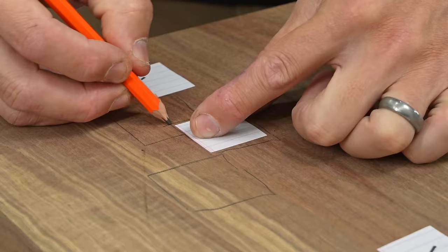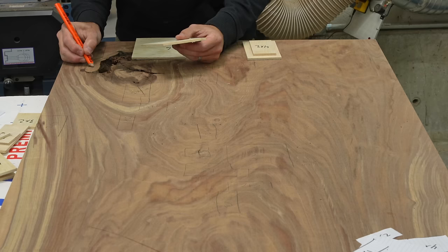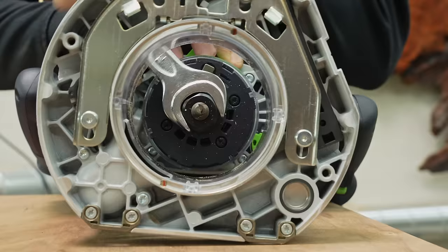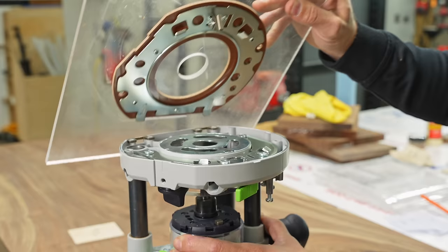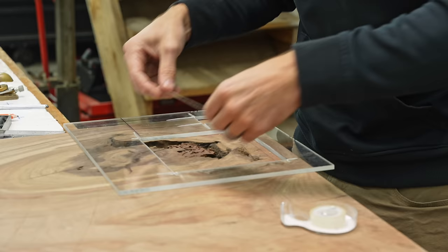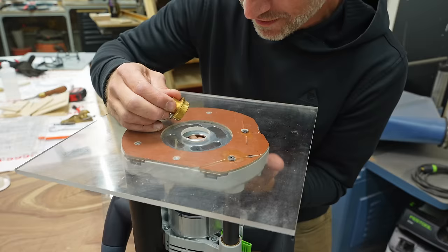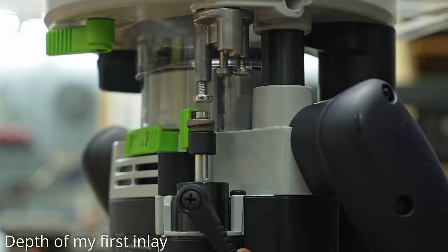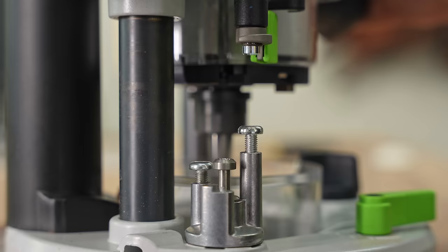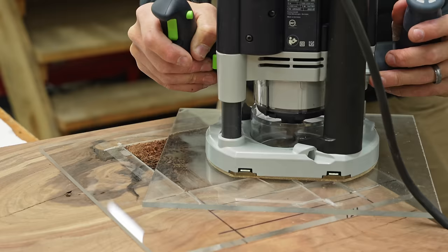I'll be really interested to hear what you guys think when it's all done. Once I had the visual representation laid out of how I wanted these patches to look, I was ready to start cutting the recesses. This is going to be done in four different sections since I thought it would be more interesting if the patches overlapped each other — I'd have to do it one layer at a time. I got my new big Festool router, added a piece of acrylic to the existing Festool base. I bought these pieces of acrylic at Tap Plastics for about a dollar a piece, cut a bunch of different sized squares. A brass bushing rides on that square edge and gives me an essentially perfectly square recess that I just have to clean up with a corner chisel.